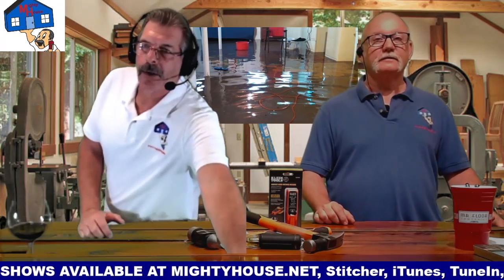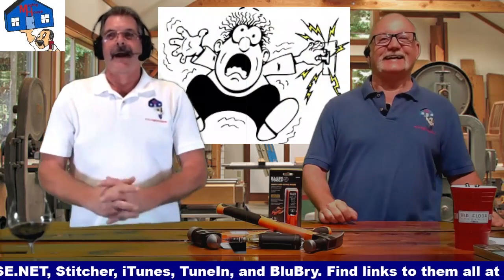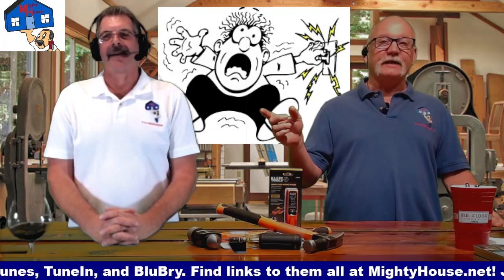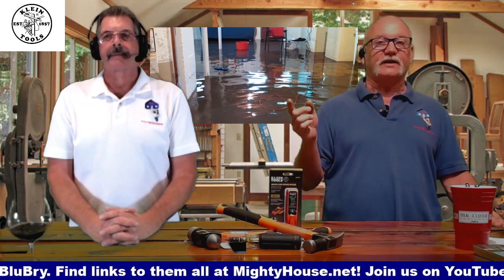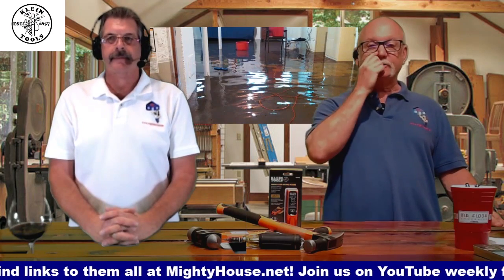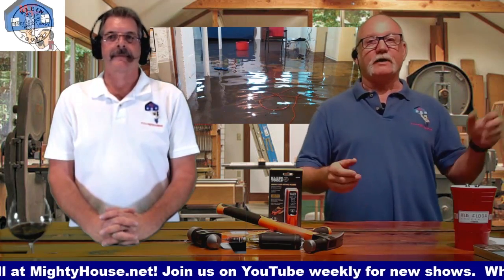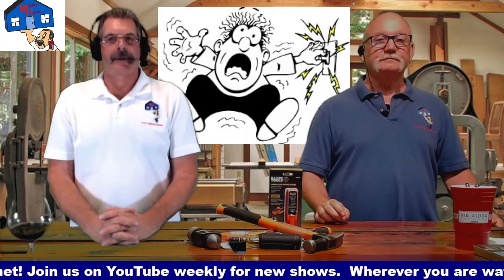So if you've got a finished basement and you may have outlets underwater, do not assume they've shorted or whatever. You could step into electrified water, and if you ground yourself, you become the path. There you go. That's it right there. You can see that previous shot had the extension cord laying in the water. You don't know if that's plugged in, if that's got a nick in it. That could be shorting out. So then you step down in the water, and maybe you slip on something, and you grab a pipe, you ground yourself out, and boom, you're gone instantly. You're gone. Done. And it's very simple.